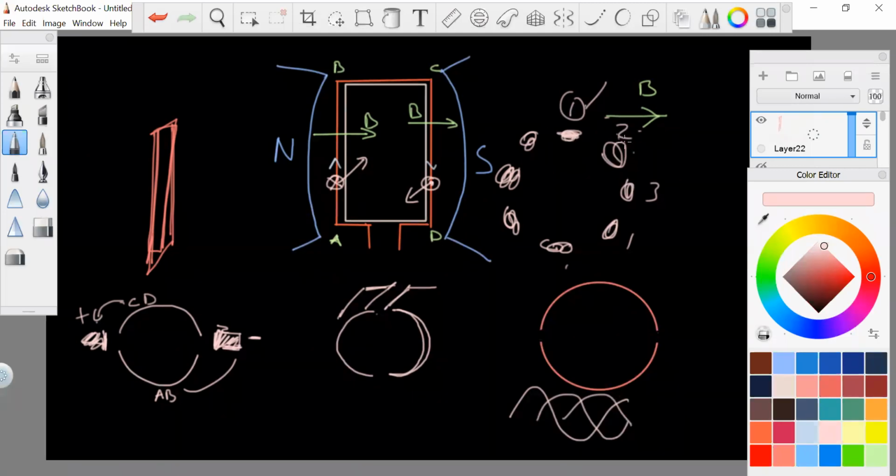So it is a simulated, virtual rotating magnet, which is true. You understand that when this was plus, it becomes minus, and North Pole is going to become a South Pole. That's the absolute difference, right? Plus to minus, North is going to become South, South is going to become North. When this peaks, it seems like North has come over here. Then it seems like North has come over here. So it seems that North is rotating round and round. Get the point? Because the current is such a beautiful pattern.